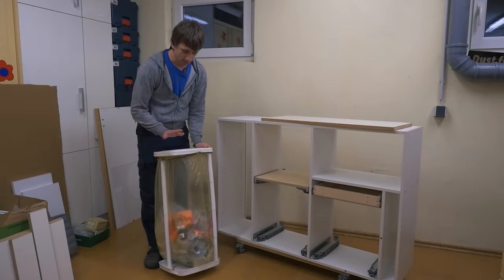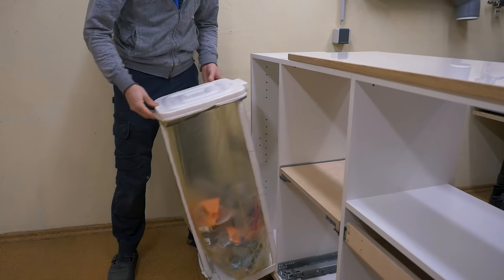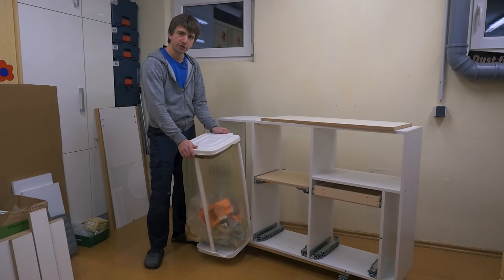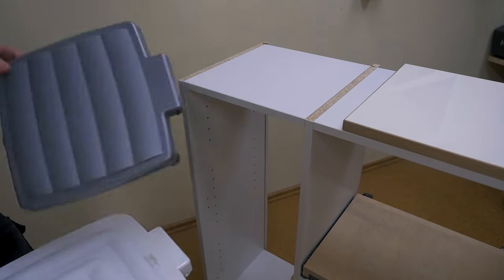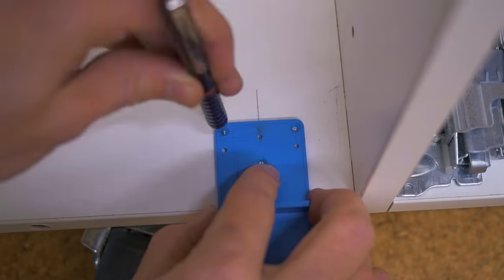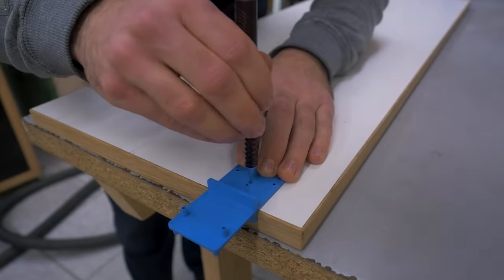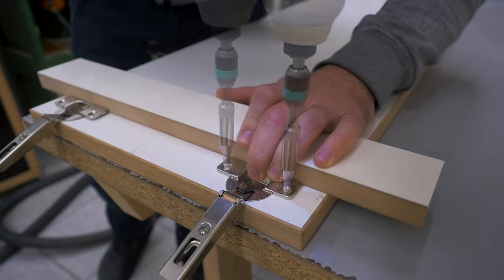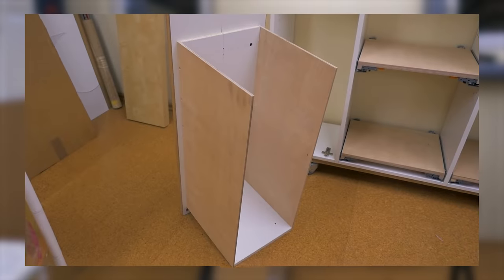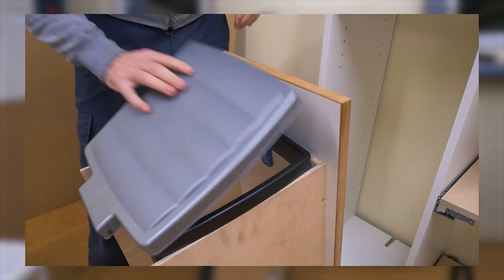Right now the plastic trash bag is in a rack thing with a lid. I want to use that lid part mounted on the front of this compartment — you tilt it open, and as you tilt it open it automatically opens the lid. That's the plan. The front gets installed with cup hinges; I marked the location using the cheap drill guide that comes with these hinges, which takes all the guesswork out of installation. Mounting the lid was straightforward with a simple screw-together half-open box and a few 3D prints matching the existing lid parts.